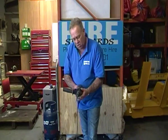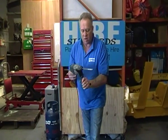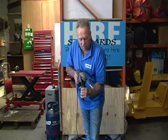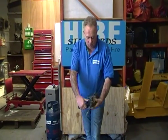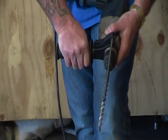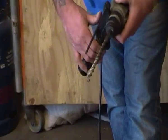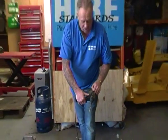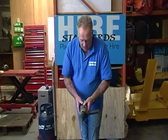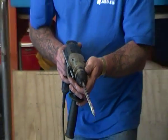Generally SDS drills are more powerful than standard drills. This one is actually only 650 watt but it's still a very powerful drill. You can see I've moved the handle round so that I can hold it firmly against whatever I'm drilling. This particular drill also has a depth gauge so you can slide that down into position, and by keeping that locked in position every hole I drill is going to be exactly the same depth — a lot of drills are supplied with depth gauges, not just SDS drills, and it makes life easier if you've got a lot of repetitive work to do. This drill also has a hammer action and a normal drill action, but it's the hammer action that we're really interested in to demonstrate the SDS.